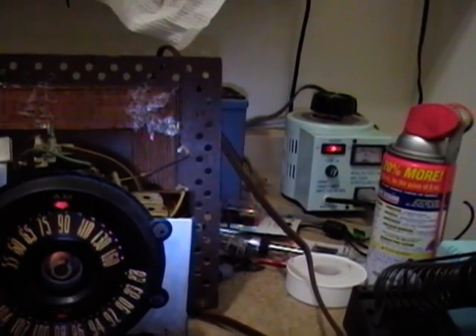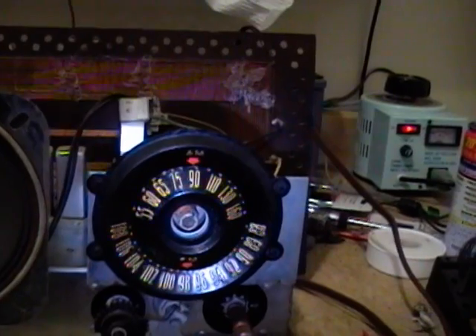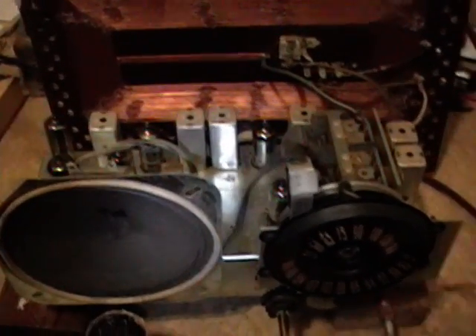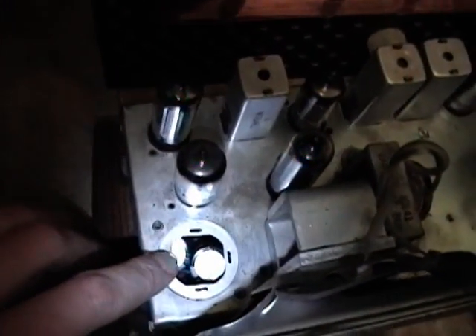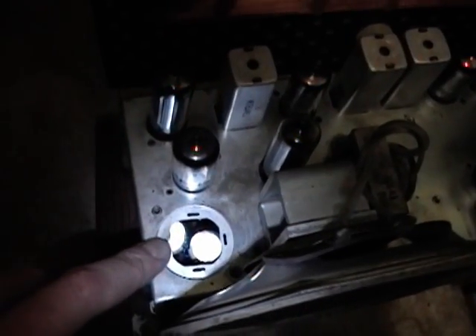There is some music. The radio seems to be working just fine on both AM and FM now, which just leaves a few tasks. If you recall, I had just temporarily tacked in some replacement electrolytics down below and they weren't quite the right value.